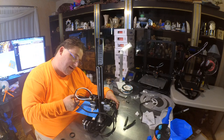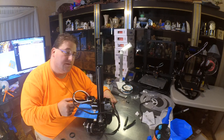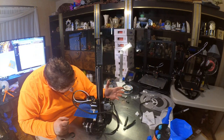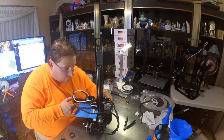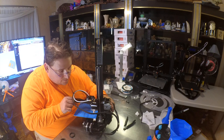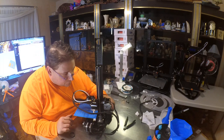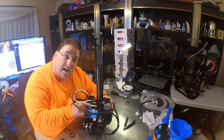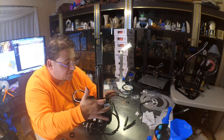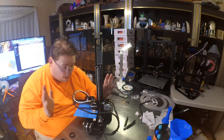I got this put on. It has a tiny bit of play in it — you can see it wobbling a little bit there. The problem is this isn't adjustable; it was never intended to be adjustable because it's fixed. So I think it got tweaked and I don't think there's anything I can do about it since it's not adjustable. I'm going to have to leave it with that little bit of play right there, and the only thing that bothers me is that play also translates to front-and-back play. We'll have to see what it does when I print with it. I might have to eccentricize the holes for one of the wheels so that I can shift it over and force it to tighten up — probably this one right here since I can access both sides without tearing the whole thing apart. Elongate two of the holes here so I can shift this and tighten up this gantry. Or maybe it won't be an issue — we shall see.